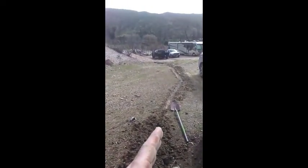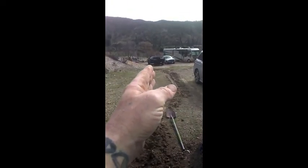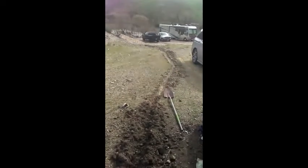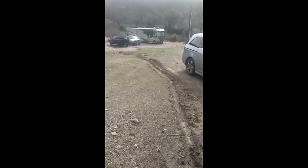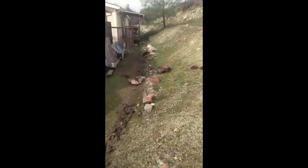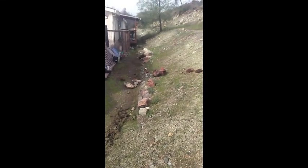It's real skinny. And then down here at the base, all along the back of the house, we'll run a French drain, and that will come out and cut across the driveway much deeper than you see. This is just our marks, and come out in a ditch at the back here. So all of this here will actually start drying out, and it'll catch a lot of the water coming down. We're at the base of a mountain here, so there's the before, and we'll show you an after. Further along, that's where it'll run.